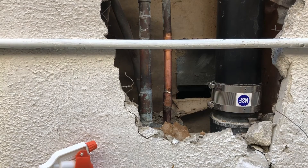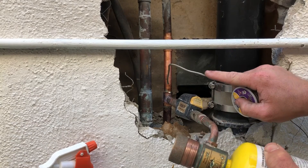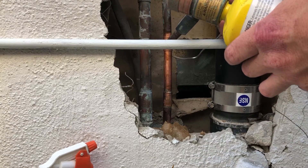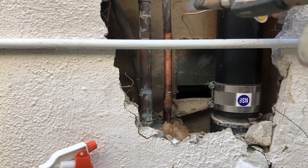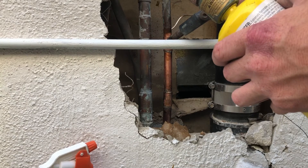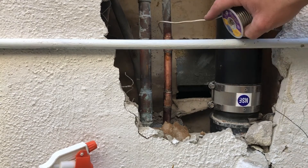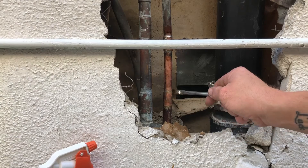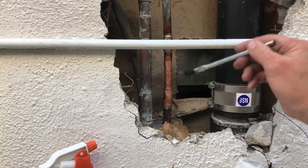This is how I solder. I use the capillary effect where you heat one side of the copper and feed the solder into the other side. You start from the bottom and work your way up because heat rises. The theory is that the heat from the flame will actually pull the solder into the joint. It works really well normally — sometimes you'll see me kind of paint the joint a little bit with my solder.